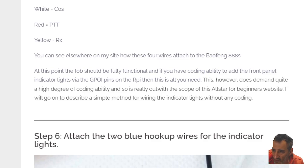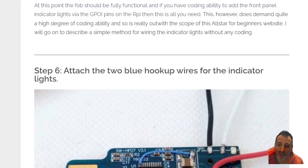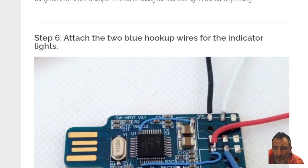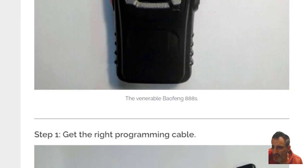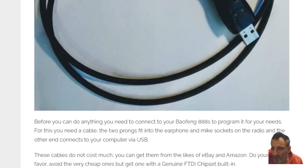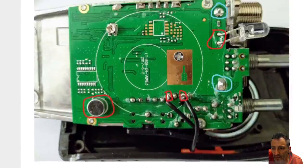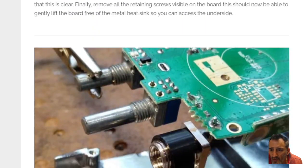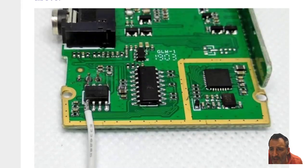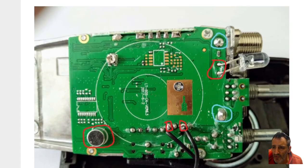You'll need to configure this onto a Baofeng UV-888. I'll be doing it — I've done it in the past but I'll do it again. Attach the two blue hookup wires to the indicator. Your UV-888 you can buy for about 10 pound. You do need to program the channels in first that you're going to use, take all the lid off. Here's where you can remove the LED. I've got a couple of wires here for the speaker — just take that off. There's the microphone, that round thing on the left, just twist it off, snip the LED going through and it just comes apart. Then the connection you take off the board, which has got those screws — one, two, one in the middle — take the board off.